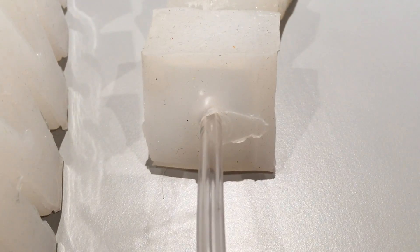Lastly, the original relied on the elasticity of the silicone to keep the tubing in the actuator. This wasn't very airtight, so the newer version has a sleeve and uses a zip tie to make the connection. If you want to build one of these yourself, I'll have the link in the description to the page on the Soft Robotics Toolkit, which instructs how to build it in more detail.